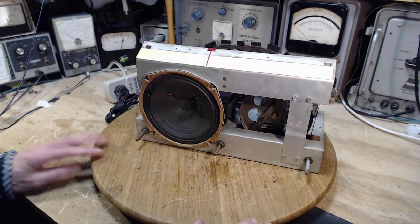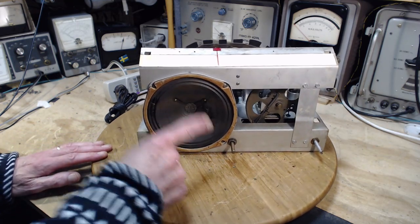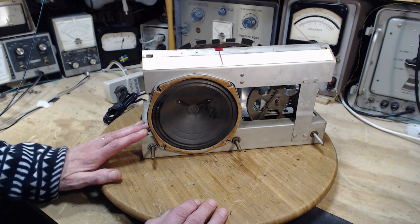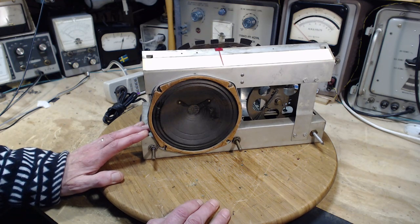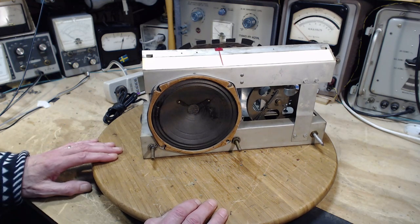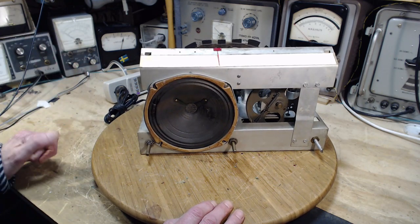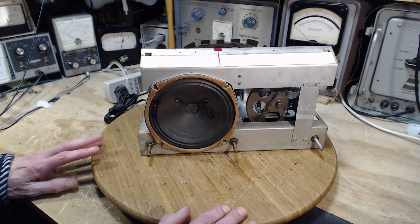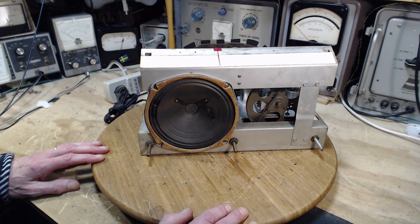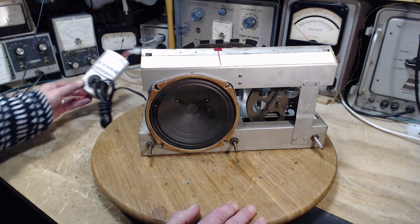So that keeps me from getting the kind of shock you could get from a radio just like this by putting your hand on the chassis and sticking your foot on the basement floor, which I will not demonstrate under any circumstances at all, ever, never, except by accident, which I hope to never do. I shouldn't get a shock in the shop here. The fact is, I would probably feel a little bit of a tingle. It wouldn't be 100% shock free, but I wouldn't get killed anyway. And that's what I'm doing for my safety here.